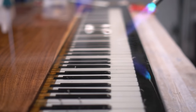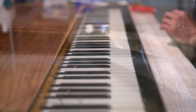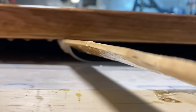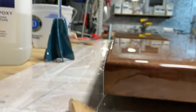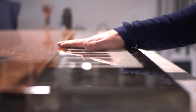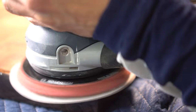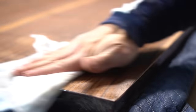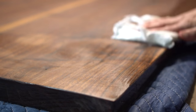It's always advisable to have a torch on hand to pop any small bubbles that might not come to the surface naturally. I let the epoxy set up for a couple hours, then come back to remove any excess epoxy drips from the bottom edge — make sure you do this before it fully hardens. After 24 hours you have one beautiful surface, but the bottom side needs sanding for a perfectly smooth finish there too. Just take 200 grit sandpaper, remove all the excess epoxy, then apply a secondary coat of Walrus Oil furniture finish — let it soak in a bit, then wipe off the excess and install the legs.